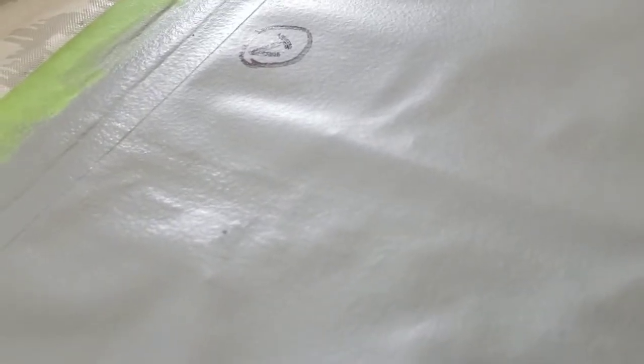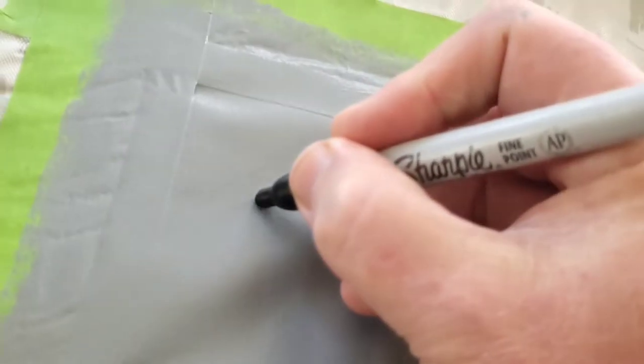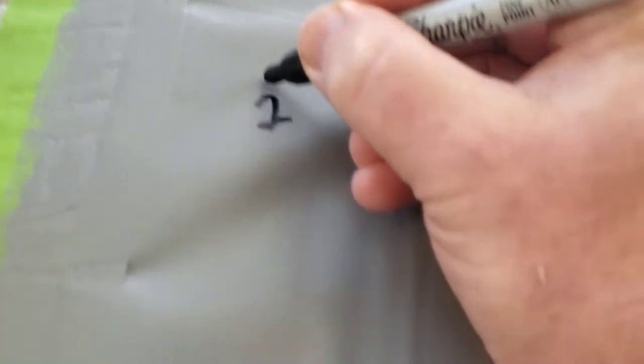And you can see that. So you can see the wash, the color is uniform across the panel. You can see that we've got a little more texture along that ridge line where we overlap the material. You can see that there. Looks like almost parallel lines running up and down the screen. But then you look on both sides opposite of that, and your sheen's great, your texture's great, everything's great. So we're going to label that one number 2. That is the thin roll.